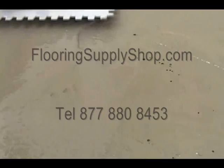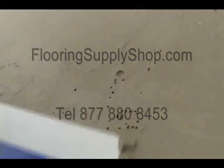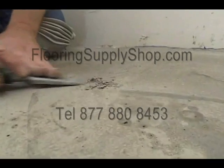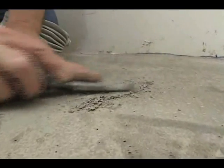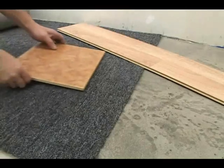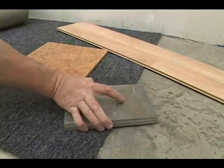You can use a roller or trowel to give a rough finish to the surface. After the floor has cured overnight, check for high spots and remove them. You can put down thinset and lay tile, or use many other kinds of floor coverings over self-leveled mortar.